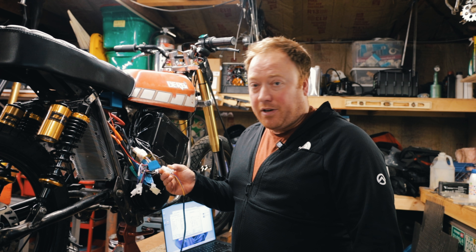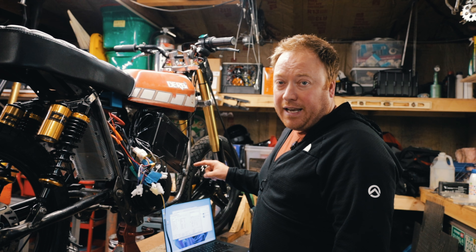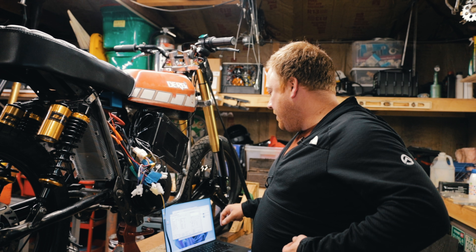Here's a quick recap: connect the USB cable to the controller, turn on the controller, connect it to the computer, open the program, select the proper COM port, click the CAN bus, then press open and then connect.